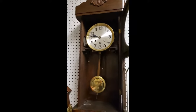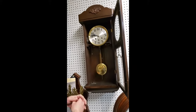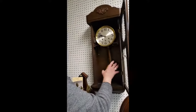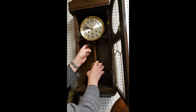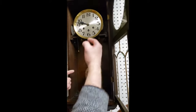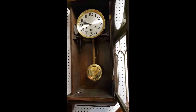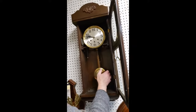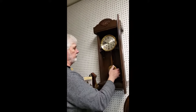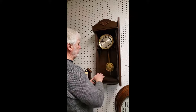If the clock is not ticking evenly and you have it level and secured, you do have to make some adjustments to make it tick evenly. The way you do that is by holding the pendulum steady at the bottom and pushing up near where the pendulum attaches to the clock, either one way or another, to change the ticking. That's something we'll save for another tutorial, so for now we'll assume you didn't disturb the swing of the pendulum or the leader for the pendulum.